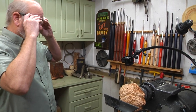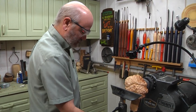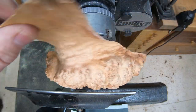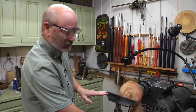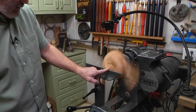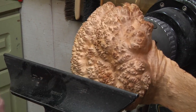So we're going to get this going. I'm going to bring my controller over here just to be on the safe side. I'm going to turn my speed all the way down and turn this on. I've already swung it a couple of times to see if things are going to hit — it gets a little close, but it's going to be fun. We're going to pick our speed up. Even something this small could shake a 700-pound lathe, so you want to take your time building up speed. I need to make sure I'm on center — if I'm using an Easy Wood Tool, I have to be on center, so I do have to stop and adjust.